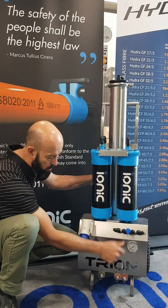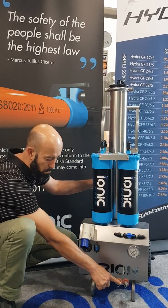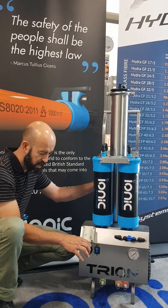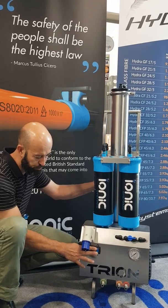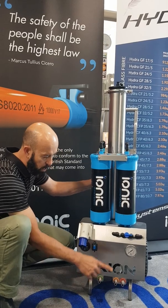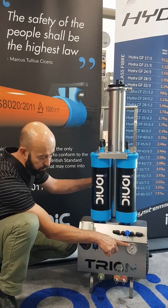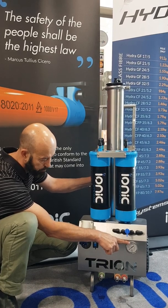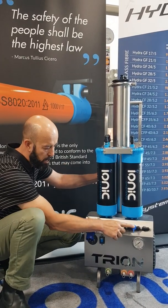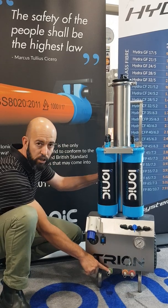The Trion will boost above that garden tap pressure. In a normal setup, we have our garden tap on and water flowing from our ports. Put the bypass valve in the inline position, which will give you maximum reject water. Once we have water flowing and our lead connected to a 10 amp power point or a generator, we're able to turn our Trion on. That will give us a massive increase in reject water and an increase in pure water. A few seconds after that, we can turn our bypass valve to the 90 degree position. We'll get an increase in pressure as our Trion comes up to maximum operating pressure, forcing maximum water through the RO filter. As soon as we go to the 90 degree position, we'll get a reduction in wastewater and a large increase in pure water.